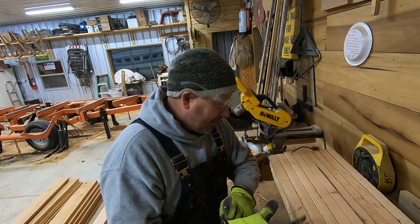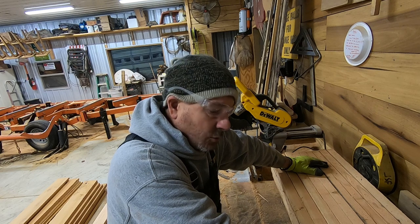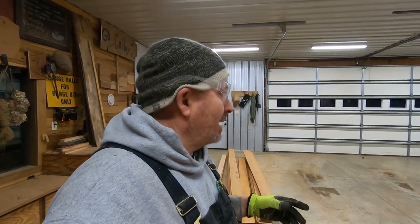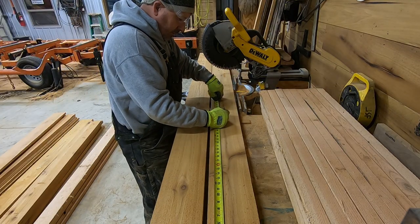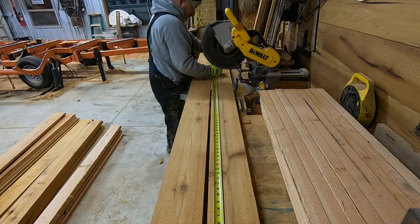We didn't have enough to make that amount, so we're going to bust code — because at Caron Creek there really is no code. We're going to put them five inches on center instead of four inches on center. Now we're going to get to the floor joist and the rim joist and make our frame for the deck and screw it together. I'll also mention: technically the shear strength when you nail a nail in is stronger than a screw. As an engineer would say, shearing down a nail is stronger than a screw. We've got our two band boards here — we'll work out our 16s on center for our floor joist.